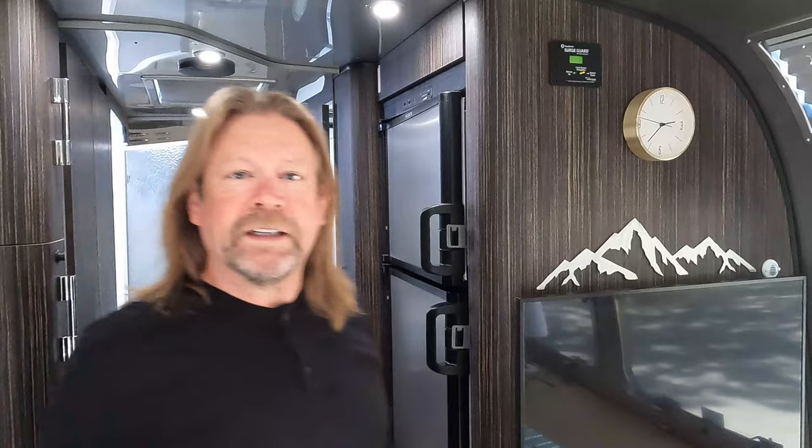If you choose to keep the batteries in your Airstream — this is totally up to you depending on the climate and how long you're going to be winterized. If it were going to be sub-zero for long periods of time, I would take the batteries out, bring them home, and trickle charge them once in a while to keep them going. We have solar panels going and we're over every couple of weeks to check on the Airstream, so I just turned off the battery connect switch and we call that good. Solar keeps everything charged up. Snow here usually sticks around a couple of days, panels are clear, and life goes on.